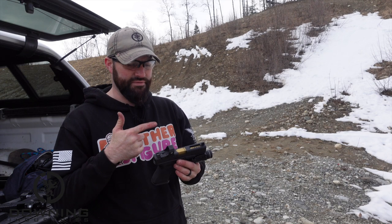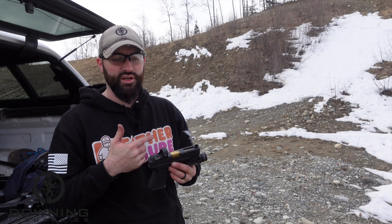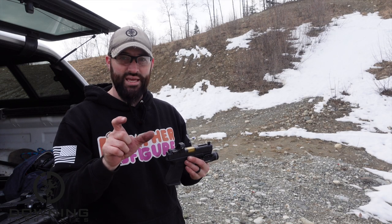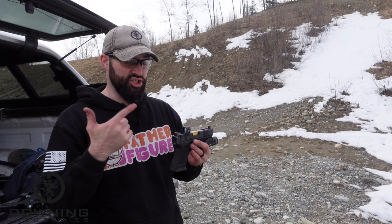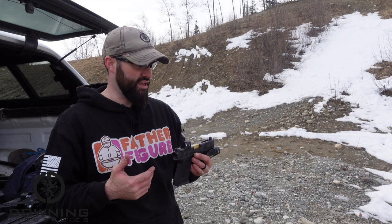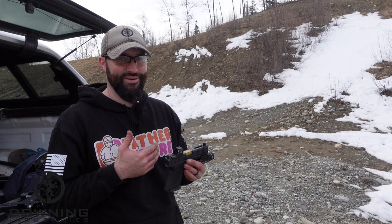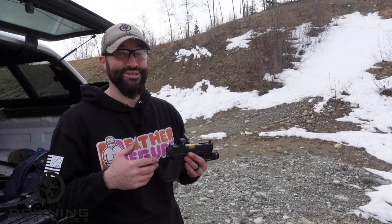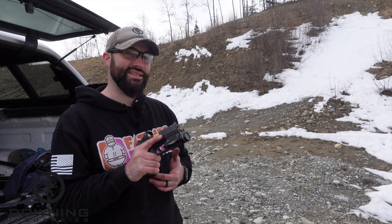What I need to do now is go in and clean this guy up - just polish the chamber a little bit. The way I like to do that: get some rubbing compound or polishing compound, stick it on one of those big fat Q-tips, chuck it up in a drill, and just polish the crap out of the chamber. Not too crazy - I'm not trying to remove material, just smoothing everything out. This is obviously not like a KKM barrel where everything is already good. It's a pretty cheap barrel, but I think it's got some potential.